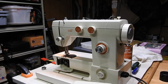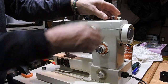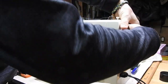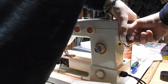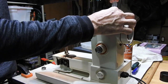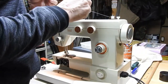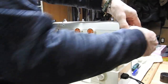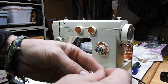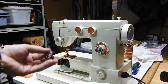We're going to rewind the bobbin. There's no on/off switch that I can see, so it's basically plug it in and it's on. The bobbin goes in here — you skip the little thread guide and go into the tensioner. Turn the clutch out, the machine is disengaged, click forward, and there it goes. Make sure you re-engage the clutch so the machine is ready to sew. Put the bobbin in clockwise — goes into the little thread guide, same as any class 15 bobbin — and it snaps right in.